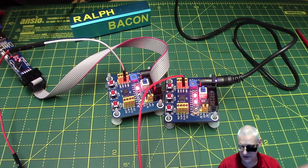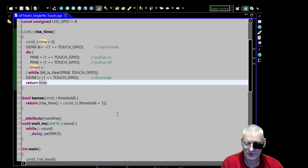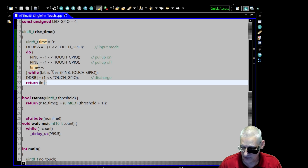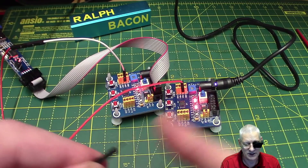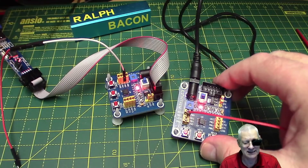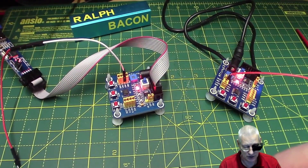You'll get two versions of the code: Ralph's original and my slightly modified version acting as a toggle. This is the ATtiny13 version — exactly the same code, no difference whatsoever. The pin references and settings are identical across both chips, so it works exactly the same way with identical self-calibration. That's what I mean about how useful these little boards are — even at $7.81 each, they're wonderful for quickly testing whether code hangs together, without having to plug everything into a breadboard.